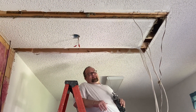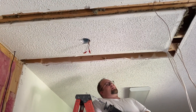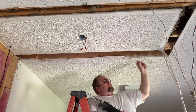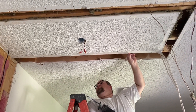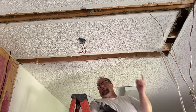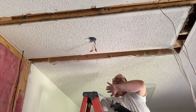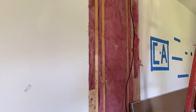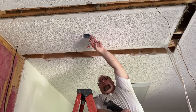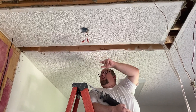Power's off, but we didn't really frame this right because they put a 2x6 on top of a 2x4 so they can join the pieces of drywall together. Meanwhile, this is teetering on here barely with a couple of nails, so we're going to take this all off and reroute these wires. This is where the closet was. We're going to move these wires to the middle pillar and put them all on the wall, adding a couple of switches. We're going to have some outlets here for our lighting and a globe top for the film.